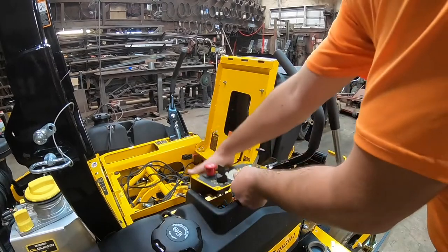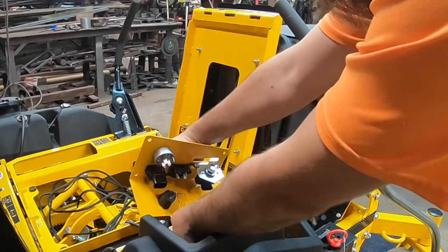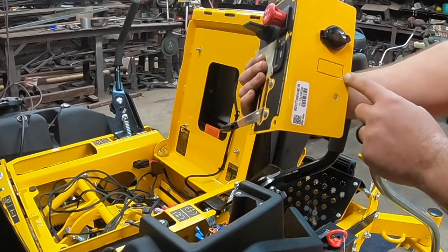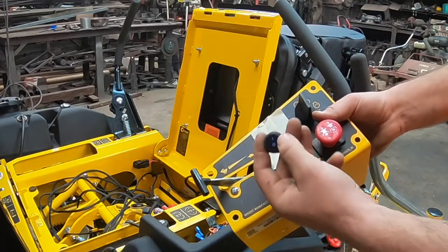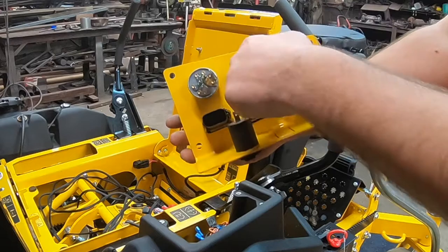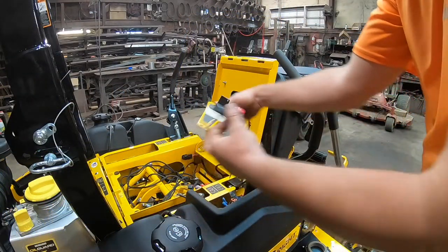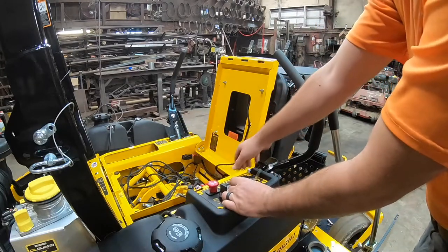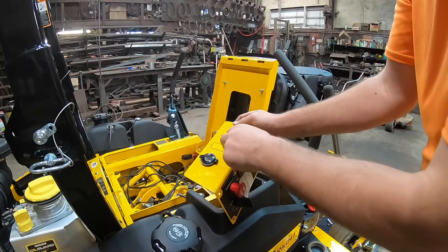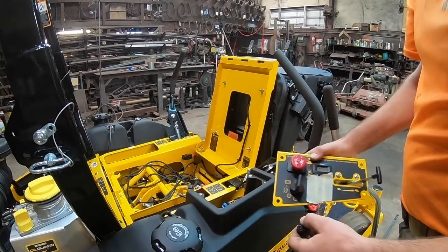Now I've got this cover loose. This was sitting in here — I took the four bolts out, peeled it up, and unplugged everything. It does have an accessory panel, so you could nip those off and put in a toggle switch, but I'm going to save that for something else. So what I'm going to do is mount a rocker switch right up here in this area. I thought about doing it down here — probably have plenty of room, but that gives me the most amount of space to play with. I already checked — there's not going to be any obstructions when I'm mowing and I'm not going to accidentally bump it. That was the only thing I was worried about if you mount something down here. So I'm going to go ahead and drill this out, mount my switch, and then the last thing I need to do is show you guys how I'm going to route the wires.